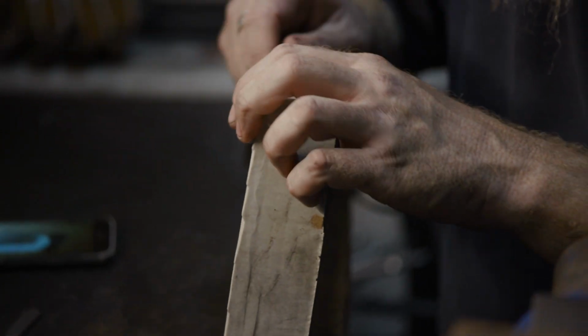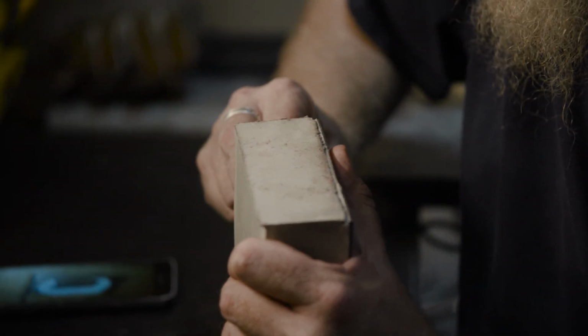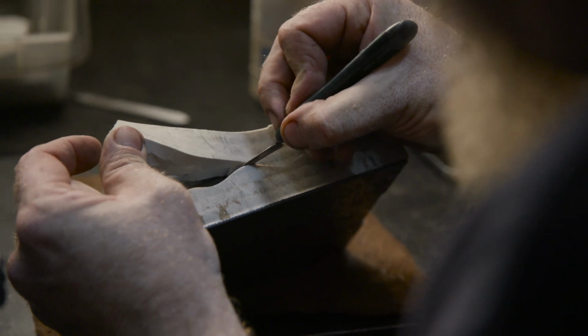But also to create the proper mold, as I cut through with the scalpel, I'll be making some zigzags going up and down. That way the mold only goes back together one way, it stays registered, and I can clamp it when I pour the waxes. I won't have big seam lines.